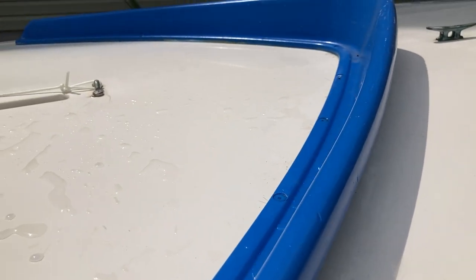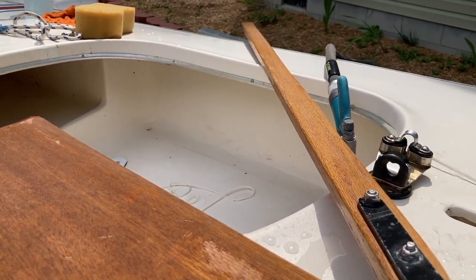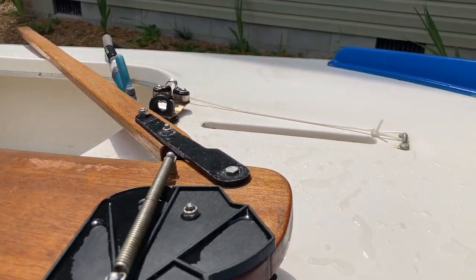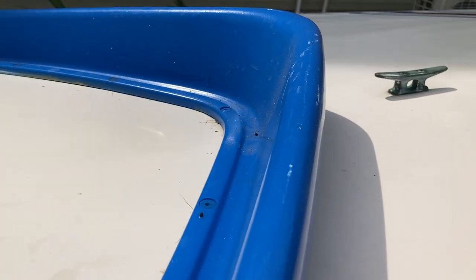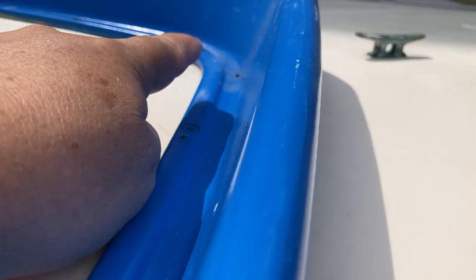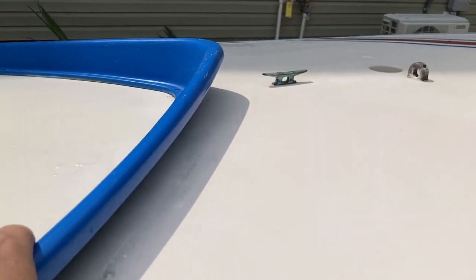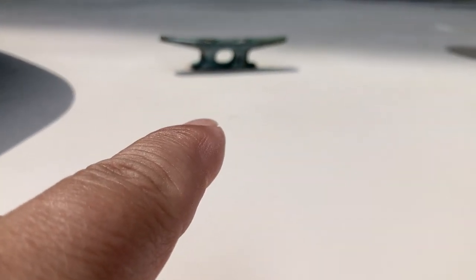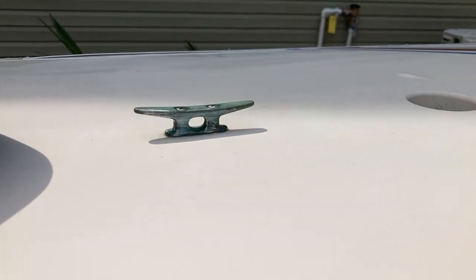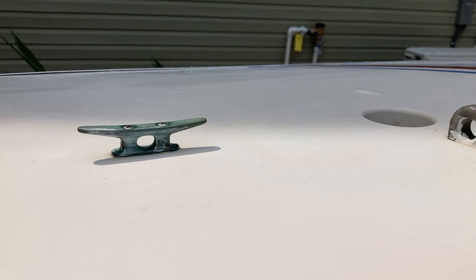It's probably good practice to tip the hull up and down and see if you hear any water sloshing around inside. If you do hear water sloshing, don't panic — it might be in your cockpit, so sponge that out first. If you do hear water running back and forth inside you know it's actually inside the hull. For example, this boat — the last air leak test about a year ago — was missing a rivet in the combing, so that was just a good-sized 3/16-inch hole letting water in. There are wooden backer blocks on the earlier models underneath the halyard cleat; about 1988 and newer there's an aluminum plate or some other plate inside.